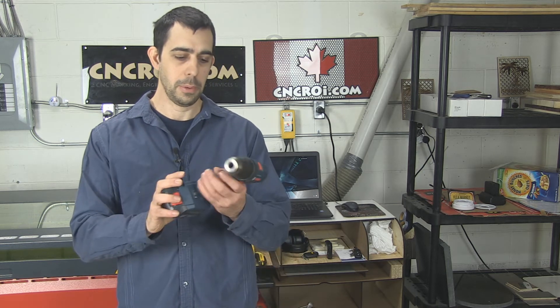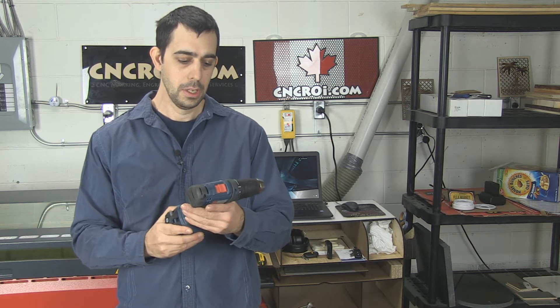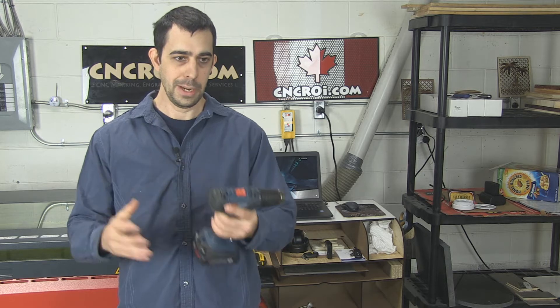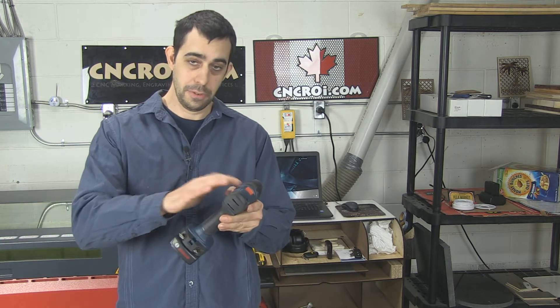You've probably noticed in one of the past videos that we actually went over a part twice. That was the top part here where I put CNCRI.com. The reason I went twice is because I was out of tolerance — that's one of the challenges of engraving a tool. It has to be perfectly level. Now if you're having a thousand tools that are the same, you build a jig for it. But some of our customers have a thousand different tools, so you're not going to make a thousand jigs for a thousand tools to be used once. You have to use your creativity to try to level it as much as you can by eye. And sometimes you're off by a third of a millimeter — if you're off by that much, there will be a difference on the tool.